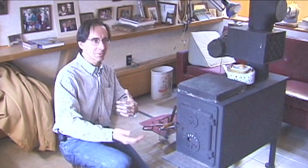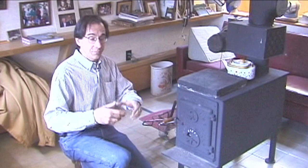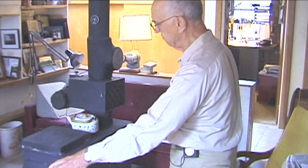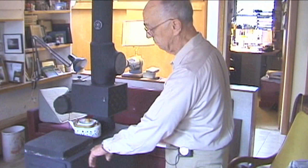This is the time of year people are looking at wood stoves, thinking about them. They might go out to Uncle Henry's and grab something cheap. If you do that and you're not working with a professional, make sure it's on something like this or concrete. You don't set it on the carpeting. The sparks will fly 3.5 feet, so you can't just come out 18 inches or so. You've got to come out a long ways if you have carpeting, because you'll burn little holes in the carpet if you aren't careful. So what have we done to the wood stove that's new and different?